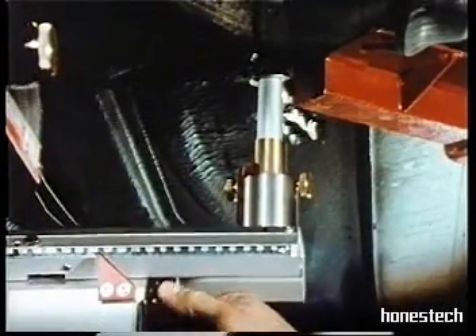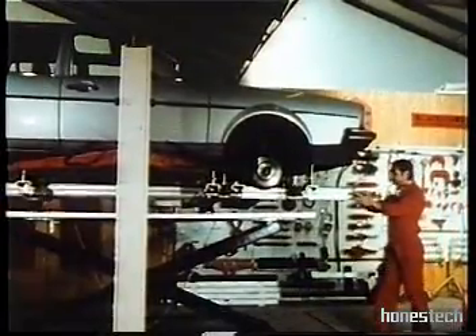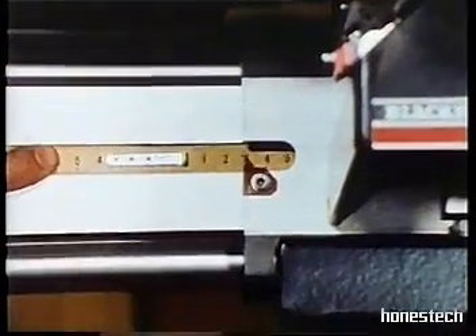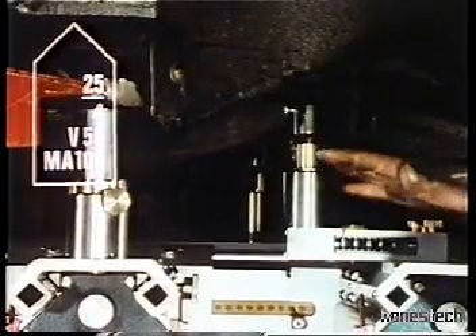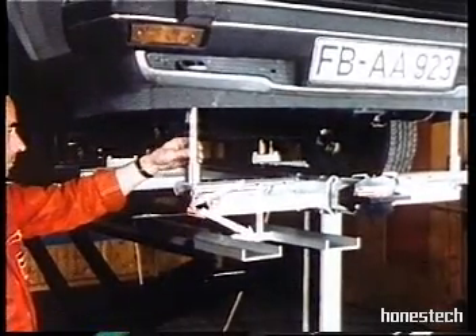Now, to raise the front of the unit. The front bellows push up. Locate and compress the scales. Both slides compress identically, confirming no twist condition. Position the beam evenly beneath the car. The measuring unit is perfectly located parallel to the zero plane — the manufacturer's datum line. Lock the cross slides in this position. Set the length tape to zero. Up to four independent slides remain available to check heights, widths and lengths. Three dimensions are given simultaneously from each cross slide assembly.